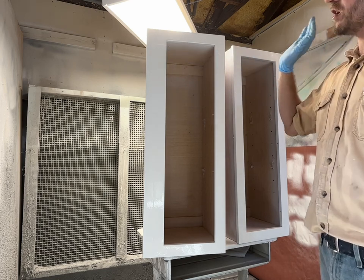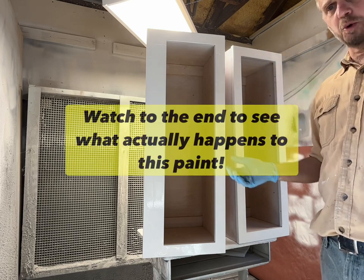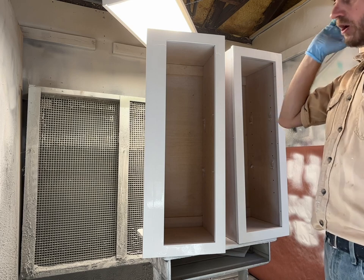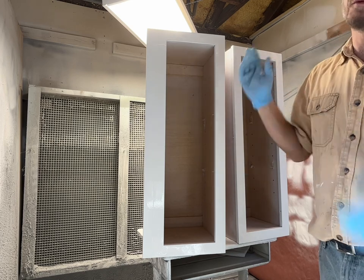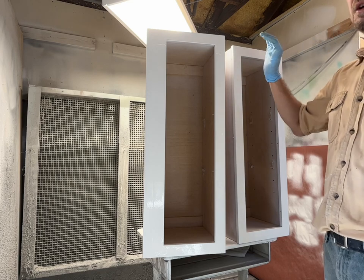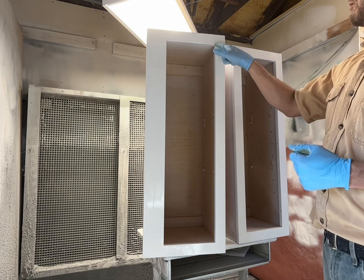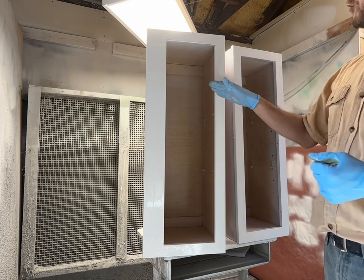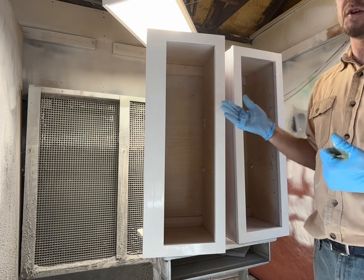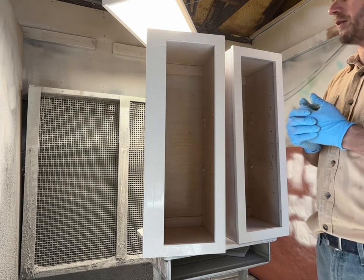Then I sanded everything flat, and I hit it with a final coat, very lightly, probably 3 to 4 wet mils, and that actually worked out great. That gives it that final sweet coat, which you really need just before your top coat. Now, we're getting pretty heavy. I find that this stuff tends to, with time, migrate a little more. When I was putting it on heavy at first, it didn't look like it was moving, and that's why I kept putting it on.